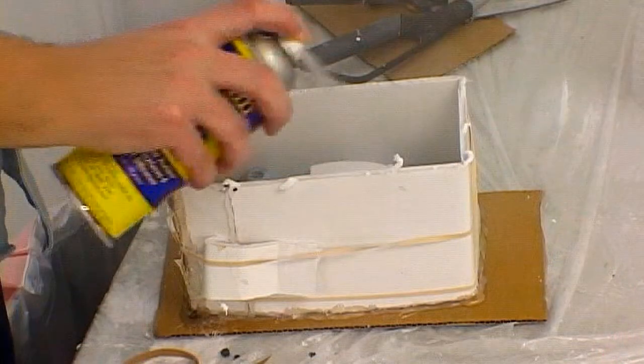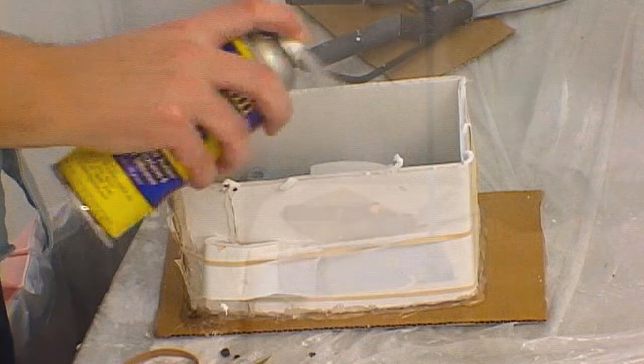In preparation for the second silicone rubber pour, the inside of the mold box is coated with a mold release. It's particularly important to cover the bottom half of the cured silicone mold, as silicone will stick fast to silicone. So spray at least 3 light coats of mold release on all silicone rubber surfaces, allowing each coat to dry before adding the next coat. Use light coats as the silicone will pick up all the drip marks if the release is allowed to run.